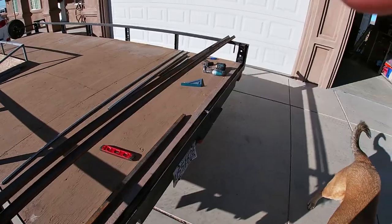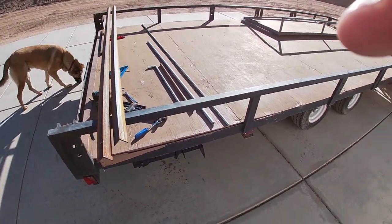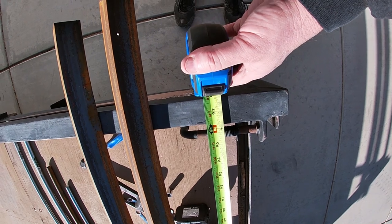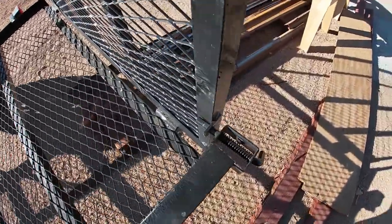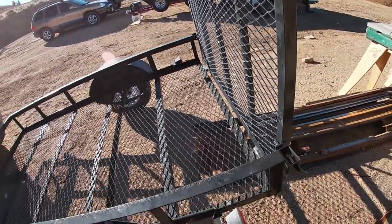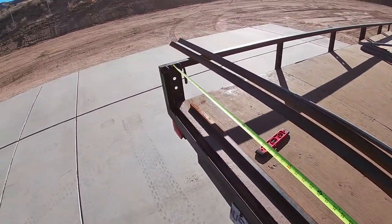The question was did I have a long enough angle iron to make the width of the gate — and I do. It's a really wide trailer, way out over the axles. I measured it at 98 inches or something; inside to inside is 96. I need to give myself about an inch of clearance. I like that because it'll make it stronger — just those two pieces of angle sitting on the rail would be prone to warping.